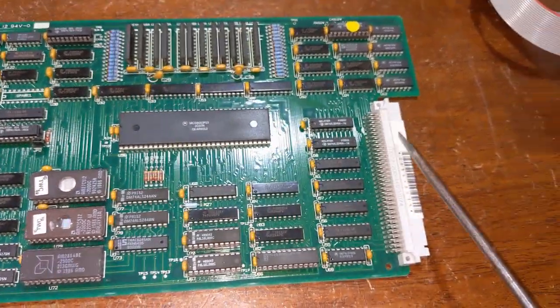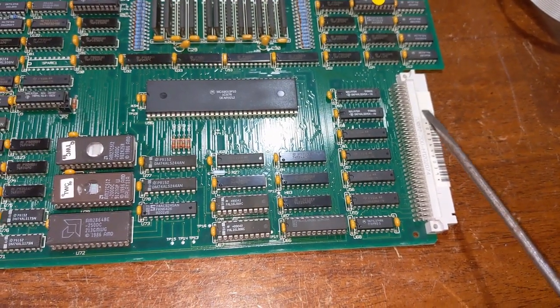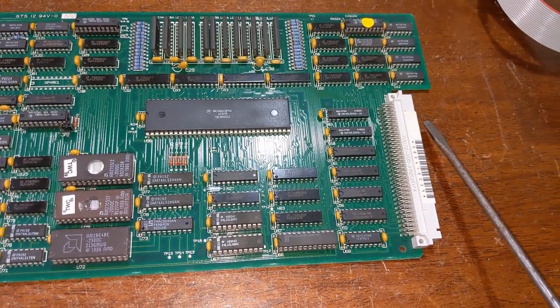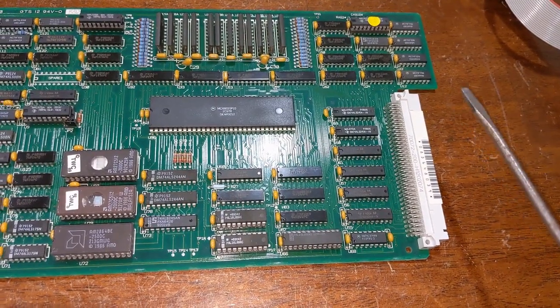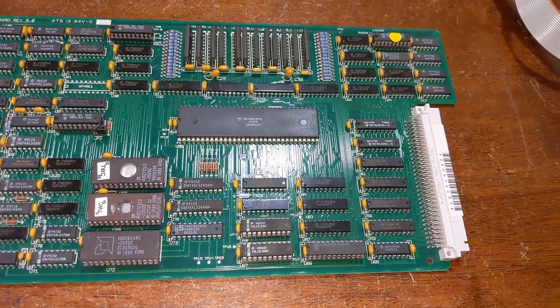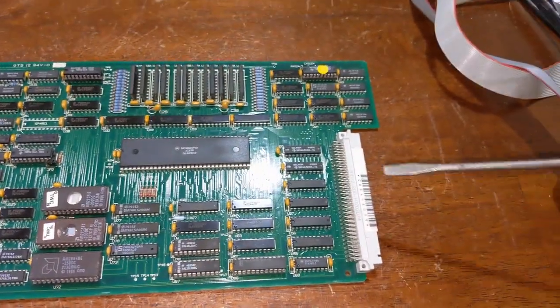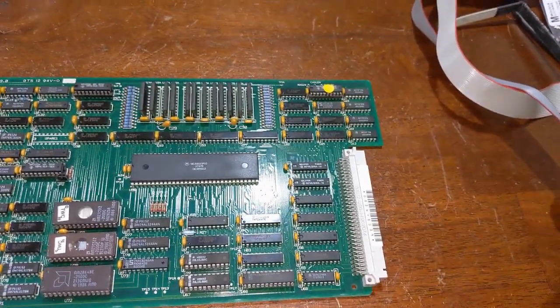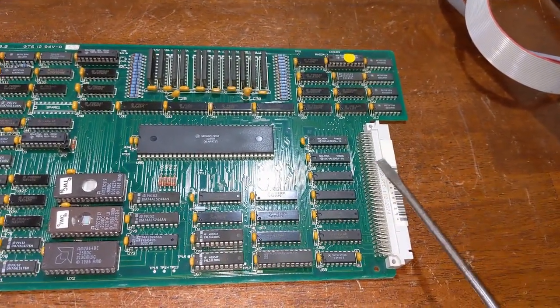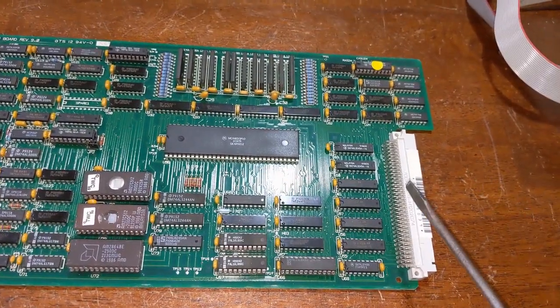And then we have a backplane connector. This is just your standard 96-pin Eurodin. And the backplane is basically what's called a VME bus, which was very popular in industrial computers at the time. I'm not sure if it still is. Most of the ones you see now have dual slots because it's 32-bit or greater. This is 16-bit, so it's only got a 16-bit slot. But this is a VME bus